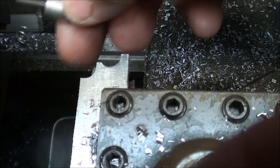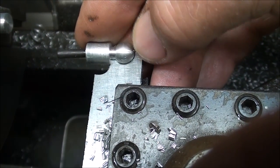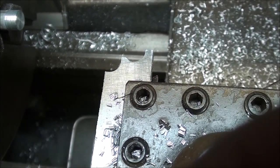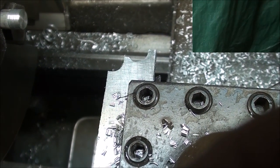The form tool is made of tool steel — that produces the ball and gives the work the form. Everything is tapered so it will cut. I used precision ground tool steel for that, quarter inch thick.